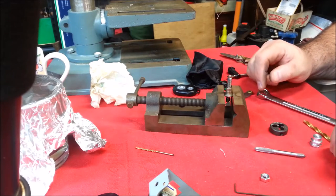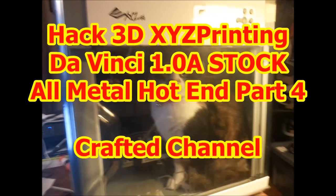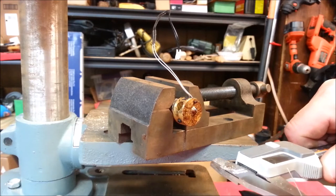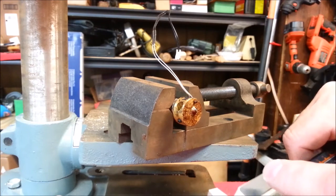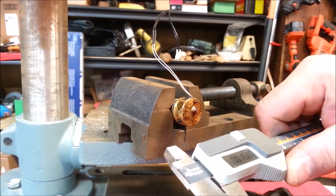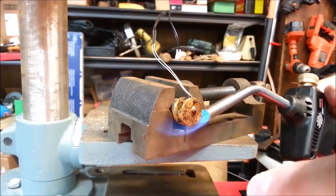There's something going on here that's not ideal, but I think I've got an acceptable fit and we can put it back together. I've got one more thing to do — I'm going to clean out the 0.4mm part of the nozzle. This wire is just under 0.39mm. It's a piece of music wire from my hobby shop, RadicalRC.com. It's 15 thousandths, so this 0.015 wire is just ever so slightly under the size of the nozzle.